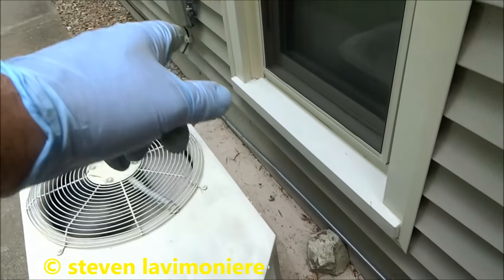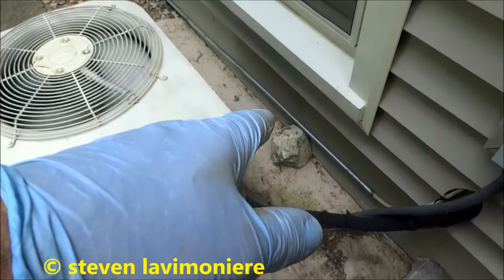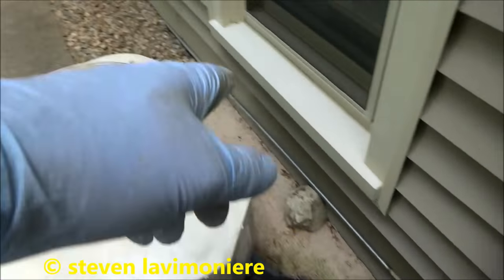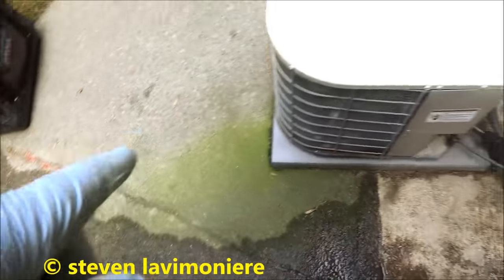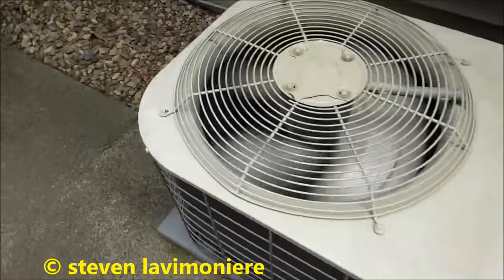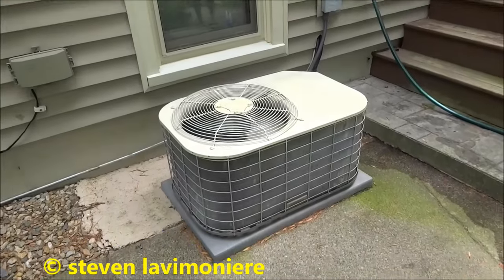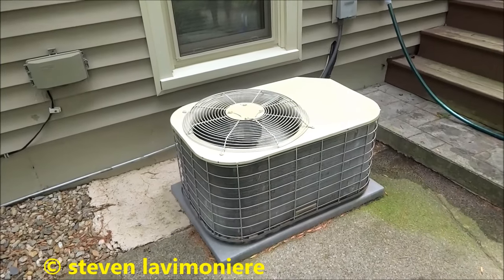Piece of conduit there. I don't have any plastic, but you could paint that. You could paint that the same as the wall, and that won't bend. And then I'll get the water away from this. Alright, thank you. But I think it's good for now. It's cooling. You know, I set the superheat and subcool. We'll let it go for now. Sure. Well, I have an hour. I have it at 50.